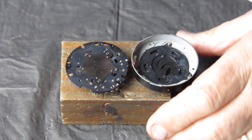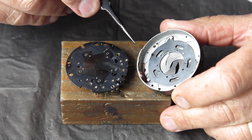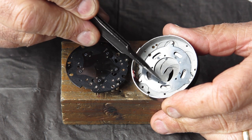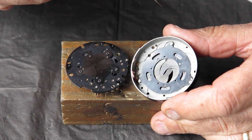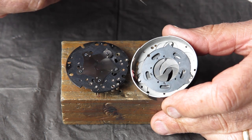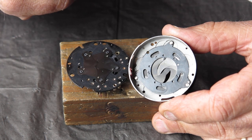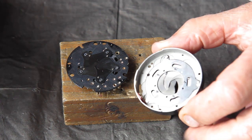Here I have the shutter split. I've got the mechanism plate out of the case and you can see quite clearly that these diaphragm blades have been displaced - the pin has pulled out of the socket here and here and presumably on the others as well. Hopefully the rivets that form the pivots on those blades haven't been damaged, and once I disassemble and clean it I should be able to reassemble it and it should be good to go. You can see quite a bit of hazy staining on here - that's typical when something has been flood cleaned or dabbed with solvent on a cotton bud.